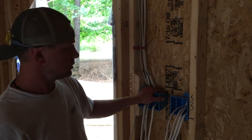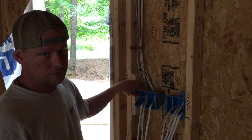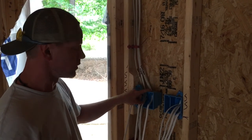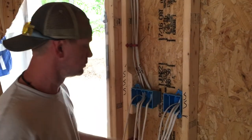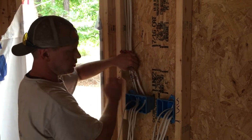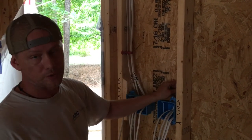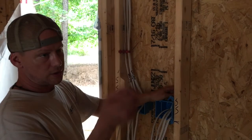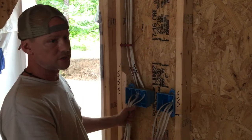So this is cutting in two boxes. One has two single-pole switches and one has a three-way switch, while the other has a three-way switch and one single-pole. Identify all the switch legs and the three wires — they're going to travel to the next switch where it's switched in different locations.